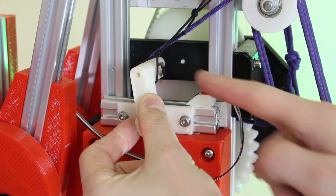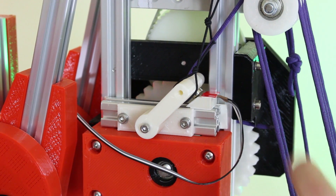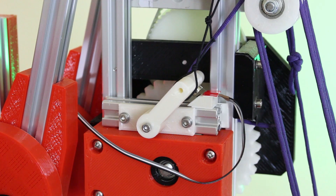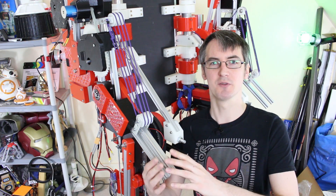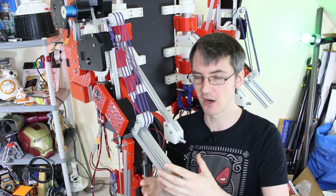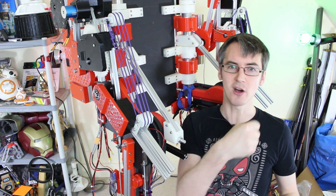I've fitted the little switcher mechanism. There's a magnet glued on the inside and the hall effect sensor is under that red tape — that's the relaxed position at the moment. There will be more weight once the hand is installed, so it will pull much closer when the strings are tight. If I move the arm upwards, it moves away and the hall effect sensor senses the distance. I'm planning big mechanical hands on the end of the arms to help tension the string and pull the magnet closer to the sensor. For now we might put a weight on there, but we also need sensing so I can manually drive the arm up and down.